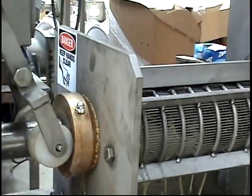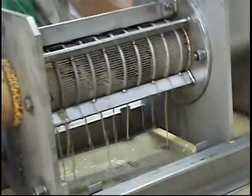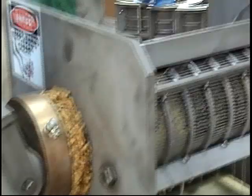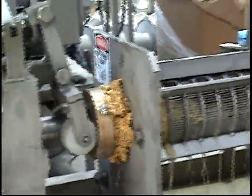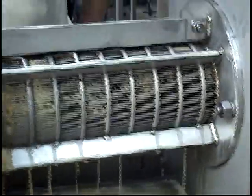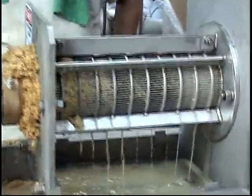The liquid's pretty dirty. We'll get samples for solids analysis. We stop to put a pressure gauge on — this is looking awfully good. We're getting a steady flow of press liquor and press cake. Bill, let's switch out buckets on three — one, two, three. Start my stopwatch. Okay, test underway — catching press cake and press liquor.